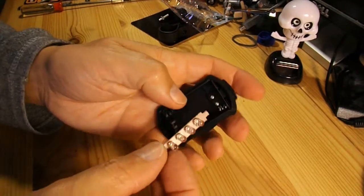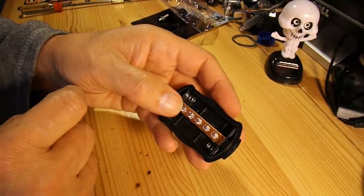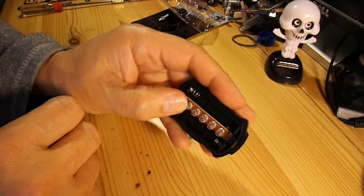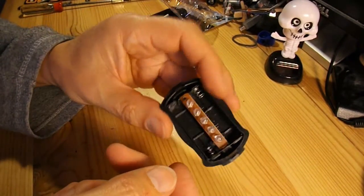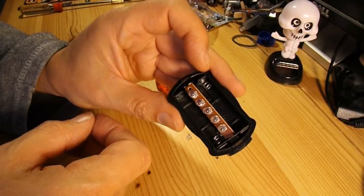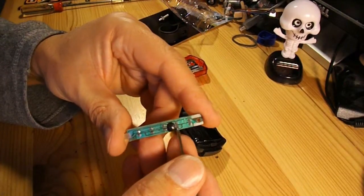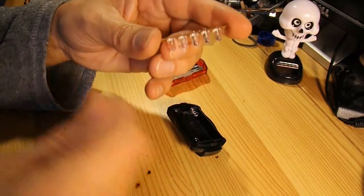I'm not sure whether I'll leave it in here and use these batteries, or whether I'll use external batteries to give us a bit more power. I think I'll try it in here first and see how long it lasts. If I find I need more power to run ten LEDs, I'll have to change the battery system. But if I leave it in here, I've got the advantage of still having the push button to step through the sequence. The next step will be to desolder those LEDs carefully, because they're a bit close to the black blob. But if I can get them off, I can have an external set of lights for the eyes.